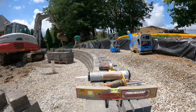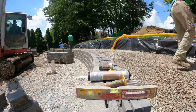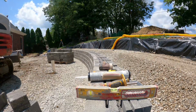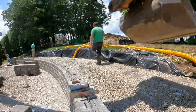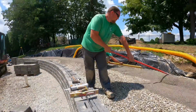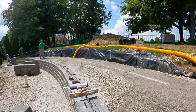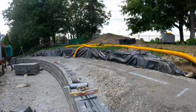Now I've got the Trimble 2D system with the Engcon there, and I'm just getting this base prepped perfectly level and compacted. We had our radius point. We're pulling a tape to make sure our radius point is lining up there with the rover. Set our rails, put some 9s in between, screed them out. And now we're gonna relay out the wall and start throwing down some base course.